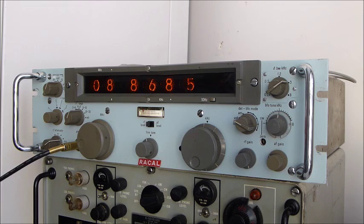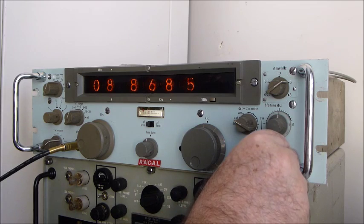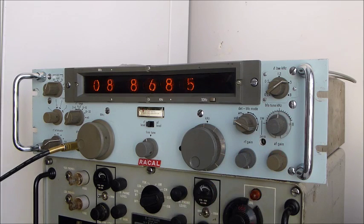The receiver, once received, had a number of problems. The AGC was not working — fundamentally, a lot of electrolytic capacitors on the AGC line had gone leaky. The counter wasn't working, and that needed a bit of TLC to work out what was going on; it came good after I pinpointed a couple of bad counter ICs. And just recently, the fast warm-up oscillator inside — which is the 5 MHz reference — packed up. The heater circuit shorted and taken out the internal regulator, but a bit of rework on that and it's all working again.